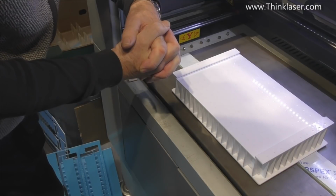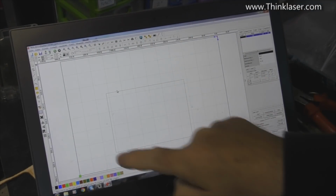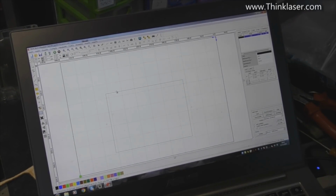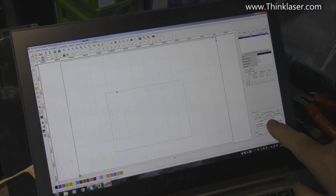And let me explain what absolute mode is for those of you that have never used it before. Well, here I've drawn a sheet of A4 size material, and across the centre line here I've drawn two holes, just here and here. Now these are going to be the fixing holes that I used on my jig. I'm going to have to put these holes into the base plate of my machine, so that whenever I put this jig back into the machine, I will know exactly where the coordinates, where the program is going to run, because I have changed this feature here called position from current to something called absolute coordinates. Now what that means is you will not be able to use the origin button on your machine.